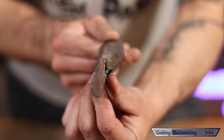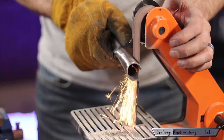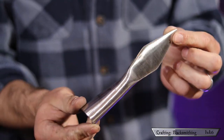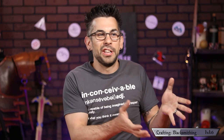With the spearhead all roughed out and looking really straight, I further honed the shape with my grinder and smoothed the whole piece out with a belt sander. At this point it was 100% looking like a spearhead, but it won't hold a tip or an edge because the metal is still soft from working it on the forge.